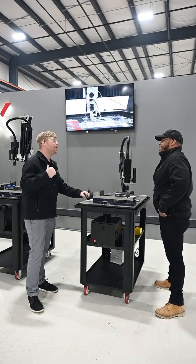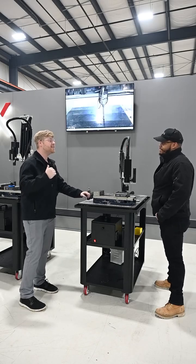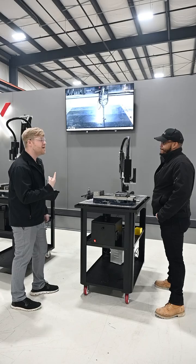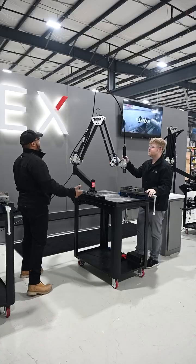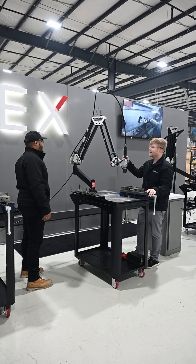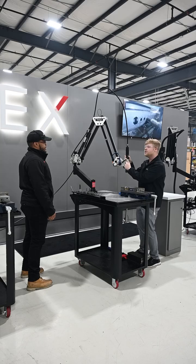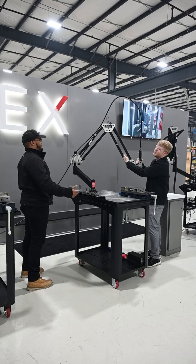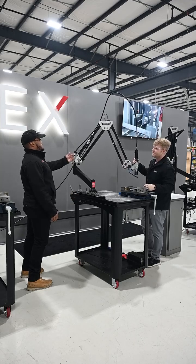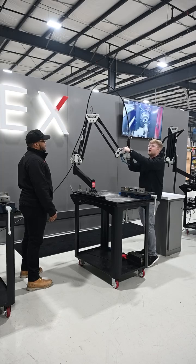I can add depth control onto a pneumatic arm. And we're not just limited at 9/16ths for pneumatic — the R&R has a 7/8ths capacity in mild steel. You can't actually tap 7/8ths with this thing. Oh yeah, you can. Gearbox — from gear 1 to gear 2, 400 to 100 RPMs, on top of a tap lubrication system built into the arm.